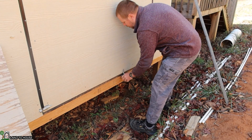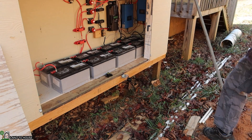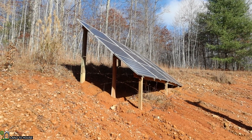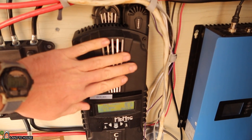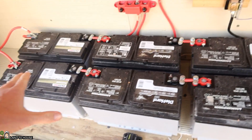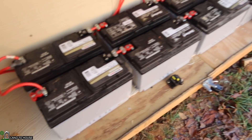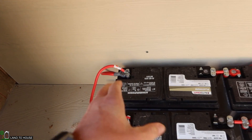Let's get started. I used to keep these electronics under my house and it was an absolute disaster, so now I've got them under here and everything looks a lot better. Up here on my hill I have 3,000 watts of solar power and I'm about to add 2,000 more watts, but that comes down and feeds into this Midnight Classic over here, which is putting out a decent amount of heat — I'm hoping that's enough to keep this little building good. All eight of these AGM batteries are going to be replaced by a single lithium iron phosphate battery that will have way more power. It might also be worth putting a tiny little heater or even a small box in here to keep it warmer.